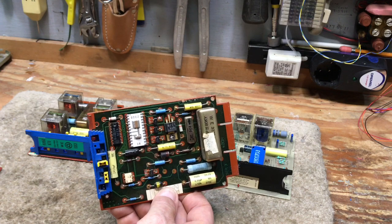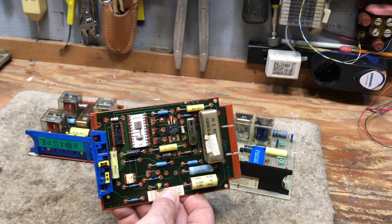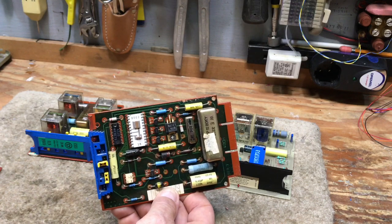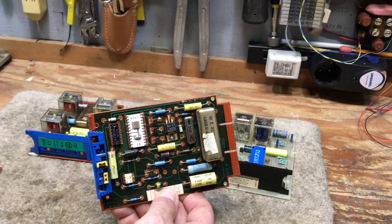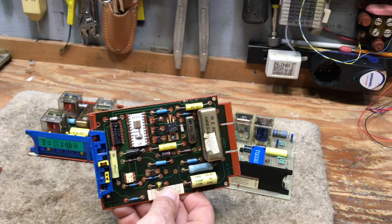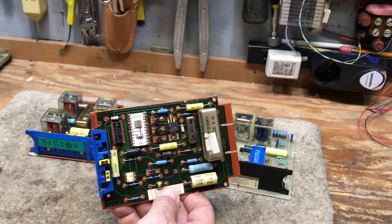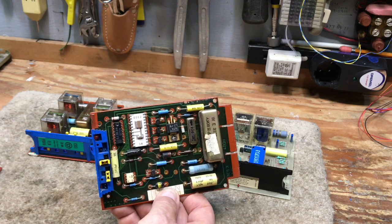In electromechanical ESS offices, such as the number 1E, 1A, number 2, number 3 ESS machines, because they were relay controlled by computers, after the register or dial tone circuit timed out, there was a DC break on the phone line that would release the hold of the line card. So at that point you would actually have to dial your own phone number, receive a busy, unless it was of course a trunk hunting, then it would just ring to the next line on your phone, and then put it on hold that way. So in my opinion, the 400Hs are the least desirable line card, but they still do work.